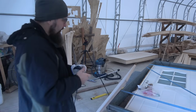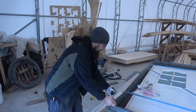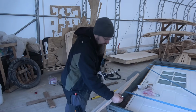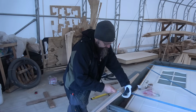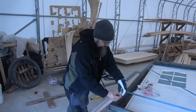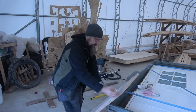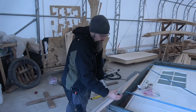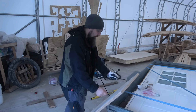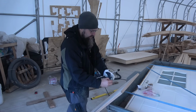And the idea with this method is to take a piece of this plywood, put a hole in there and this thread nut underneath, and then put this bolt in there, and the bolt will go through and against the floor. That way I can put 4 of these bolts in a single piece of plywood and balance it perfectly with the level or laser or whatever, and just by adjusting these bolts I can put it up or down.